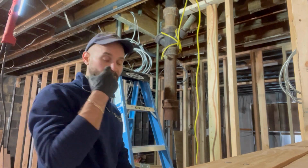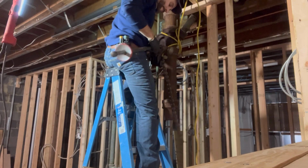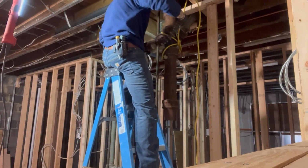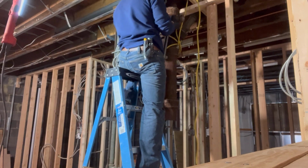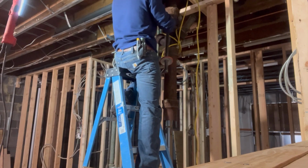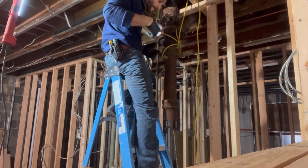Don't be alarmed. Right now, we're going to set our cutter up there, and we're going to snap. Guys, this is live stuff, live raw footage right here. You want to set your snap cutter nice and straight. You want a nice cut. Make sure you got enough meat for a coupling. You want to tighten this guy right here. Bring that to cut, and that's what it is.